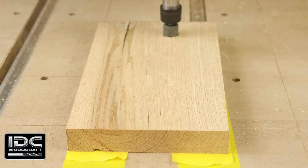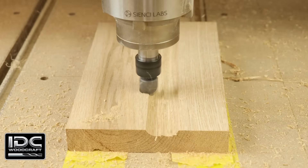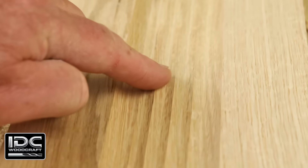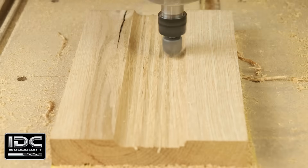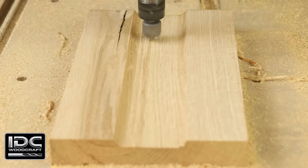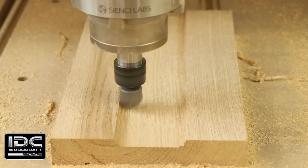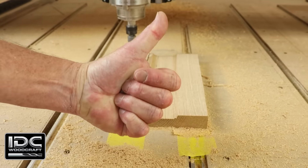Here's an example on the machine: a three-quarter-inch ball nose at 50% step-over makes very few passes but leaves clearly visible scallop marks — very exaggerated. When adjusted down to 5% step-over, the ball nose cuts nicely and cleanly, with a smooth, high-quality finish.